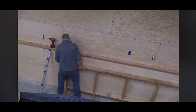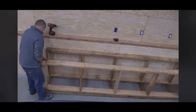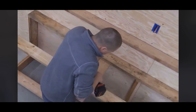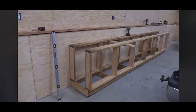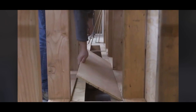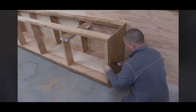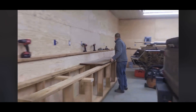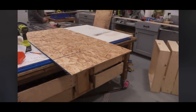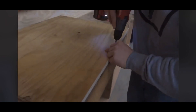From there we built two pony walls and set them on top, which works as the front and back of the workbench and gives the framing for it. From here you can just add inexpensive plywood scraps to cover up the bottom and the ends. We put three-quarter inch plywood on the top to give it a nice work surface, and then we built drawers to fit in the upper portions. We're still using this workbench today — it worked out really well.